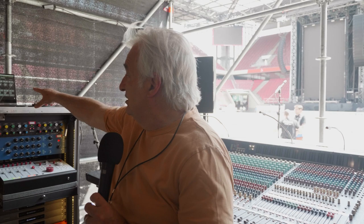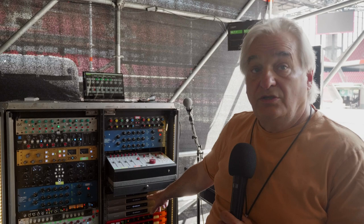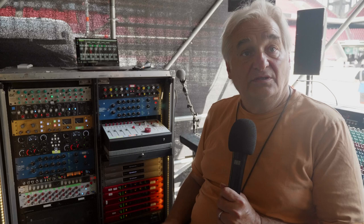There's a broadcast mixer that travels with the band. He and I share the preamps — we decided early on we wanted to use those as the front end of both our setups. They're controlled by the laptop up here on top. There are eight-channel units, so there are 64 total preamps. It's converted to Dante, and while it's in Dante, UAD servers are added to the drum channels.